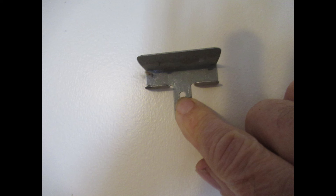There are also vinyl strips that you can buy that you nail to the wall, and then you screw your drywall to those, so the drywall is not hooked to the rafters and the rafters float free. There's also an L-shaped clip that some people purport to be the solution for the rafters, but I don't see how it really helps anything — what it does is allow the rafter to slide up and down like it's going to anyway.